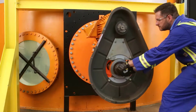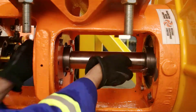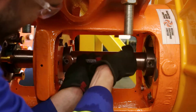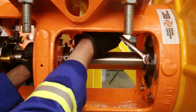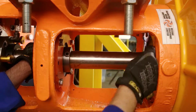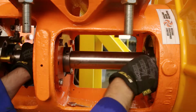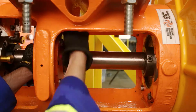Next, we're going to lock out the mixer. The shaft moves forward into a metal-to-metal tapered shutoff. Loosen the set screws and lock nuts. Note that there are three set screws on the inboard bearing assembly and three set screws on the outboard bearing assembly. First, loosen the nuts — you can rotate the shaft by hand to make this a little bit easier. Now loosen the set screws. The set screws should be backed out about a turn and a half so they clear the shaft.